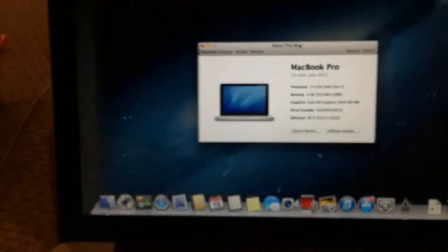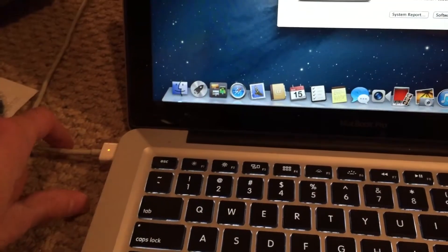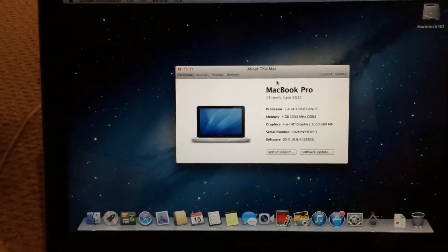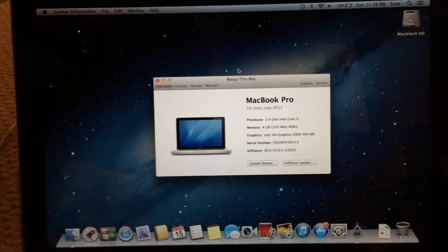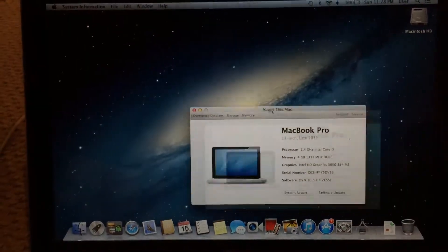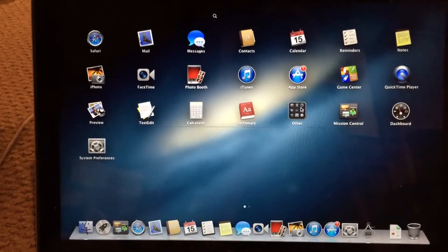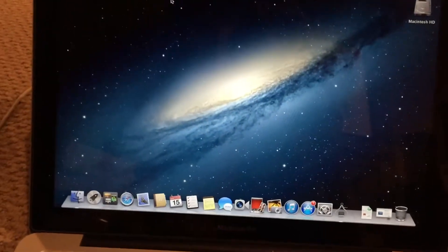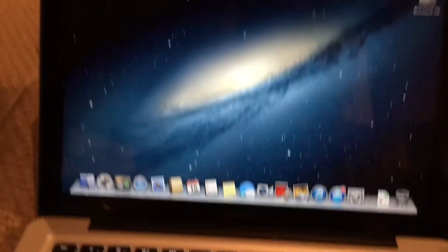As you can see it's plugged in right now, the MagSafe is charging the battery and it seems to be running perfectly fine. However, as soon as I unplug the charger you'll see what the issue is. The machine is still running, but when I start moving the mouse and dragging a window around things start to look kind of weird — it's laggy and jittery. Opening a folder in Launchpad is completely jittery. So yeah, this machine is practically unusable when running off the battery.